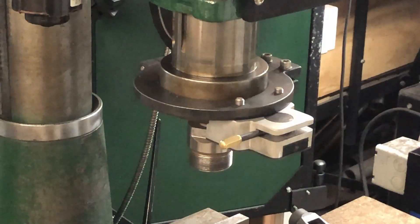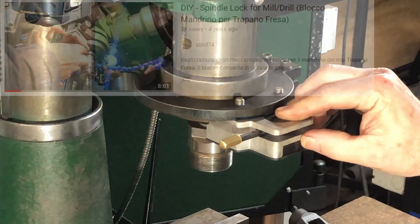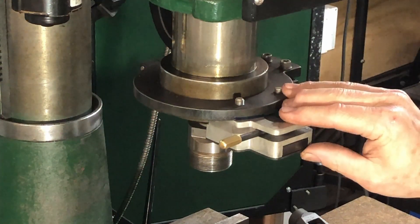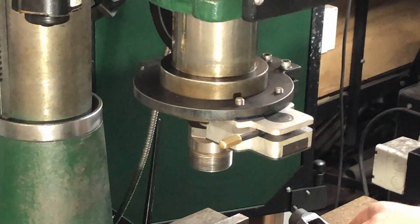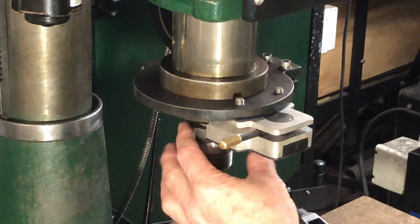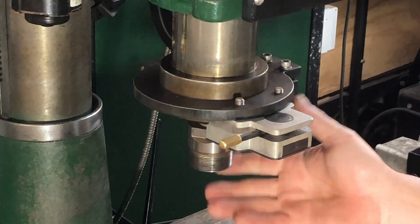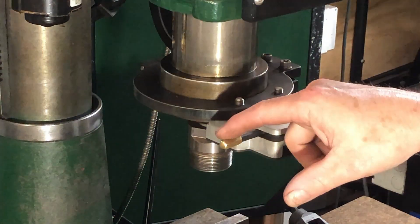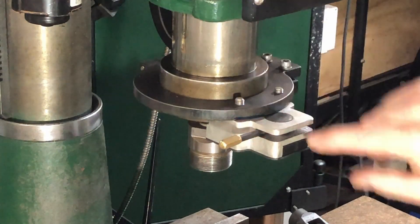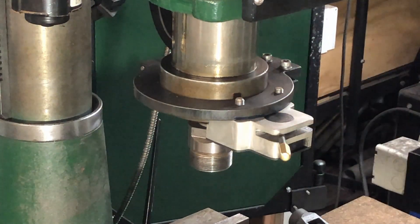This is something you may not have seen before - I actually did a video on this and got the idea from someone else on YouTube. This is just a spindle lock. In the past I had to use the ER32 spanner on the nut and have another spanner holding the spindle, and when I loosen the tool off sometimes it'll fall because I don't have a third hand. This is a cam mechanism - when I pull this lever around, it slides in and a pin goes into the spindle once it's lined up.